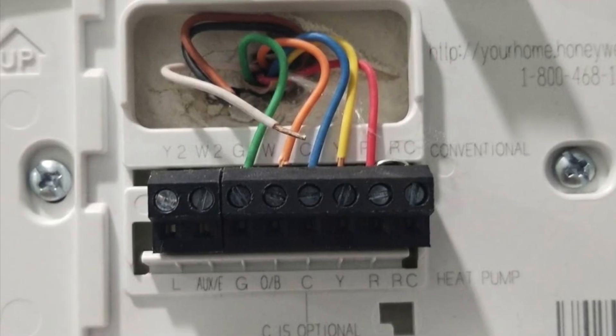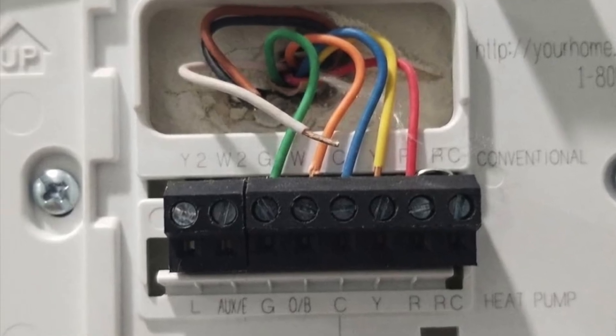What can you do about that, or what can you ask your pro to do? There are times — I used to have a friend who would either remove the white wire entirely. He did that in his own home — just literally remove it and have it sitting in there. So if he ever woke up on a cold morning and it just was not keeping up, he could then connect it and have the auxiliary heat kick on. Of course if you haven't run them in a while, it's going to have a burning smell where it's literally burning the dust off the heat strips. But on mild days and nights he would literally remove that wire and just get a little puff of cold air when the system went into defrost.